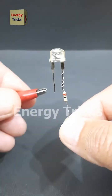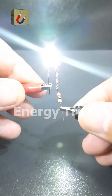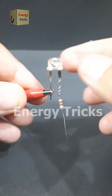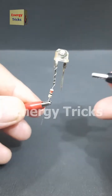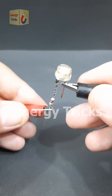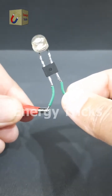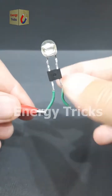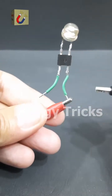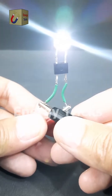This is an LED. Now let's connect it to a 3.7-volt battery through a 100-ohm resistor. As we complete the circuit, the LED lights up, indicating that the current is flowing in the correct direction. Now let's reverse the polarity by swapping the battery connections. Since LEDs are diodes, they block current when reverse biased, so the LED does not light up. To solve this issue and allow the LED to work regardless of polarity, we'll use a bridge rectifier. Now we reconnect the battery and the LED lights up. If we swap the battery terminals again, the LED still works, demonstrating how the bridge rectifier automatically corrects the polarity.